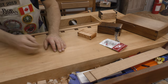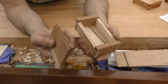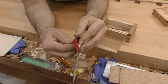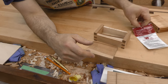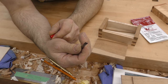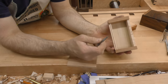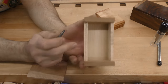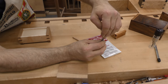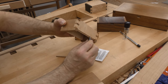If you'd like to make them yourself — here's one that's partially open so you can see how it's done. You build your box, but you have to rout a groove. We actually supply a core box bit, also called a round nose, which cuts a true half round. You put that in a router table — the easiest way to do it — and cut a portion of that circle on the back of your box before it's assembled. Your fence covers part of the bit so only a portion is exposed, and you run the box back over the bit.